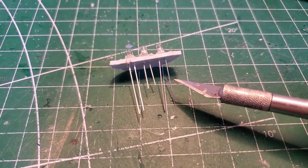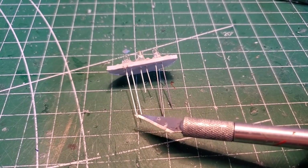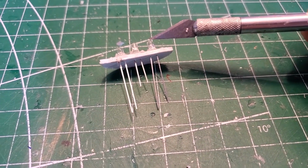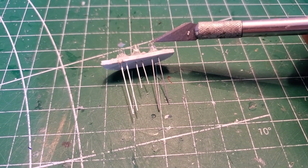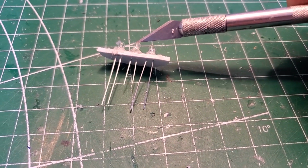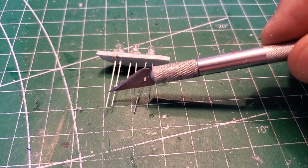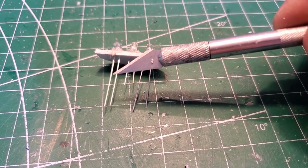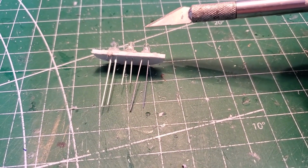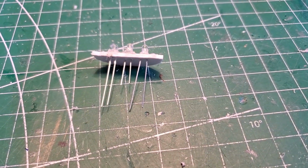Okay, I can tie the negatives together, but all the positives here are going to have their own resistors, just because, you know, like say the red just loves sucking up the juice and it's so easy to light, it has to have a higher resistor on it. The white here, a lower one, and the blue is the hardest to light up, so it'll probably have the lowest resistor out of all three. And they should all be lit up about the same brightness once I get it all hooked up.